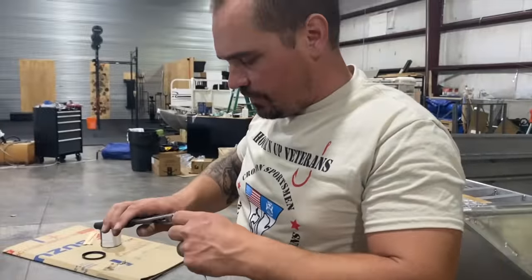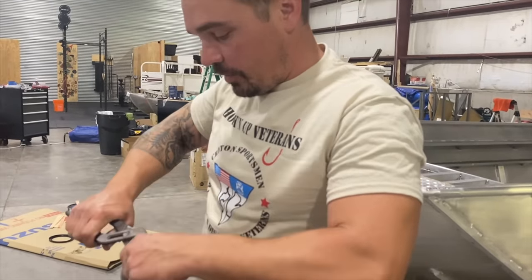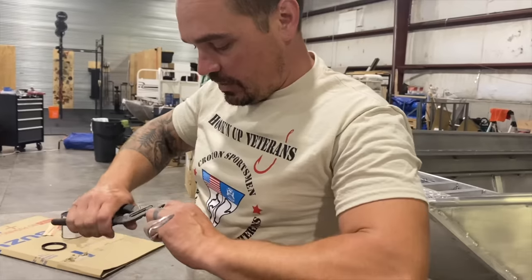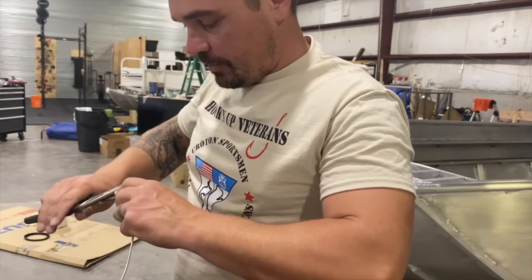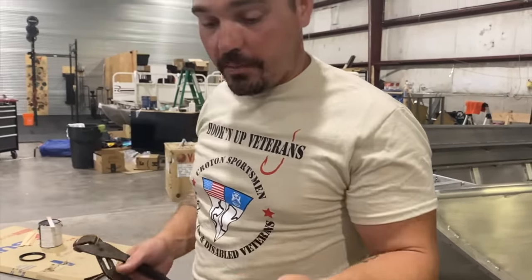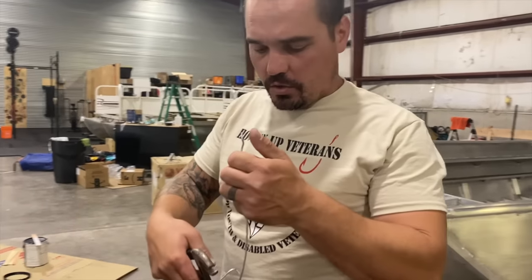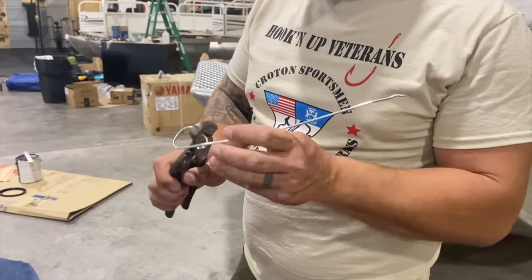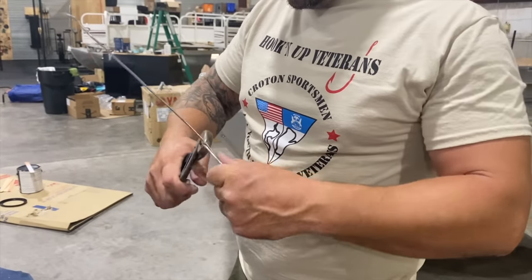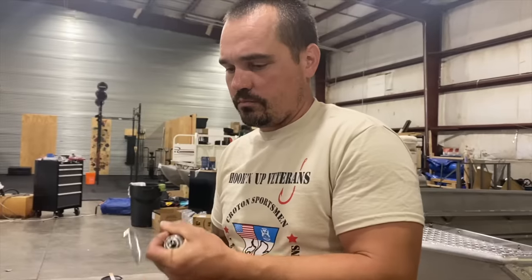So what we gotta do before we apply the Tough Coat is we gotta put the Tough Coat primer on. And I basically just followed their YouTube videos on how to apply the primer. Really simple. We acid washed. Now we're gonna prime. But there's big goopies in it. Is that the proper term? So I wanna stir it better, try to smooth it out. I don't know if they're all gonna come out in terms of those goopies, but by golly, we're gonna try.